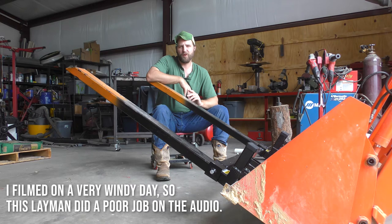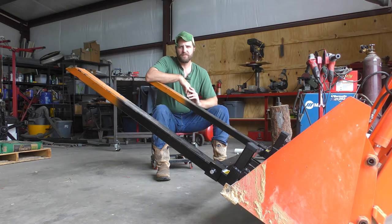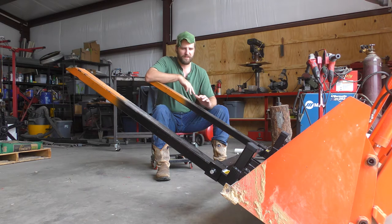This week we're back in the pole barn. Gotta figure out how to use a tractor to lift up these metal trusses. So what I'm thinking is making some extensions with some angle iron I got over here. It's an inch and a half or two. We'll go look at it. But basically, extending these forklift spikes another 5, maybe 8 feet.